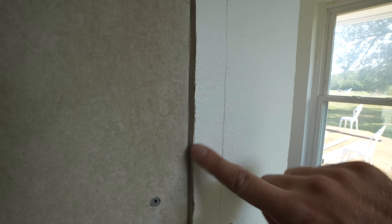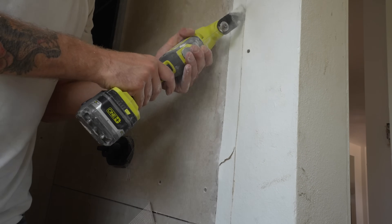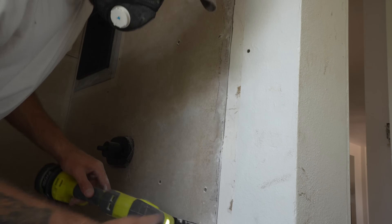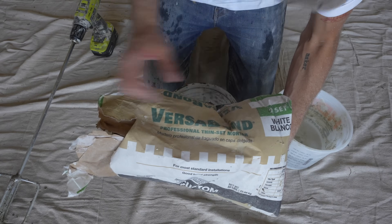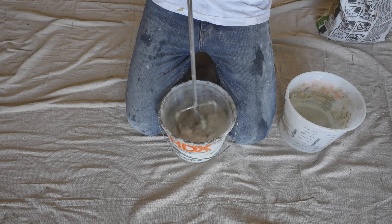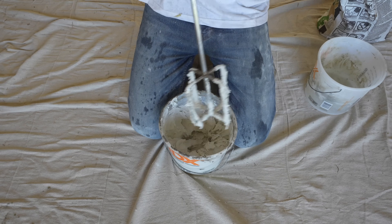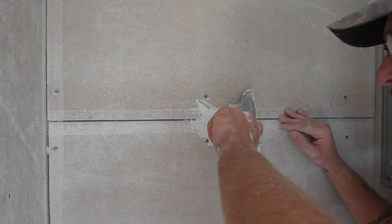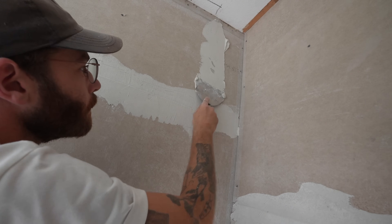I'm working in a remodel, and right now my drywall sits proud of the cement board a little bit. So to get them flush I used my oscillating multi-tool with a flat plunge blade and just removed a little bit of material so that I could tape and thinset this just like the other seams. I'm using leftover thinset from my kitchen backsplash — it's pretty standard stuff, and it's white, which is convenient to see against the gray fiber cement board. I'll mix this up; I'm looking for a stiff pancake batter consistency, something that will spread well.